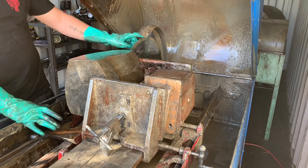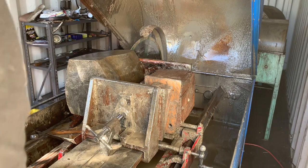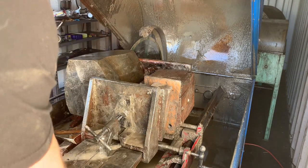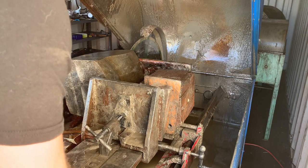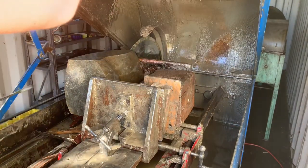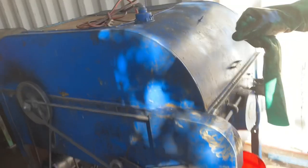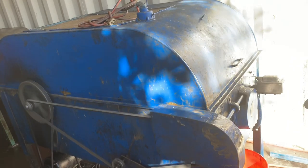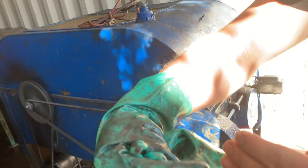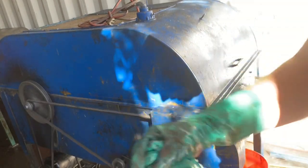We don't want to be above the top of the blade when this back corner gets close. So I think it's a good thing that the cut's going to end about there. Let's do the old start and stop trick, and we'll make this flat contact even flatter. Just letting it barely touch, and then we'll back up the carriage and we'll start it again. So with the start and stop technique, you need a pretty flat contact already. If it's like moving over just a little bit, that's about enough. But if you have something that's too slippery to get the cut started, then this notching technique doesn't work.